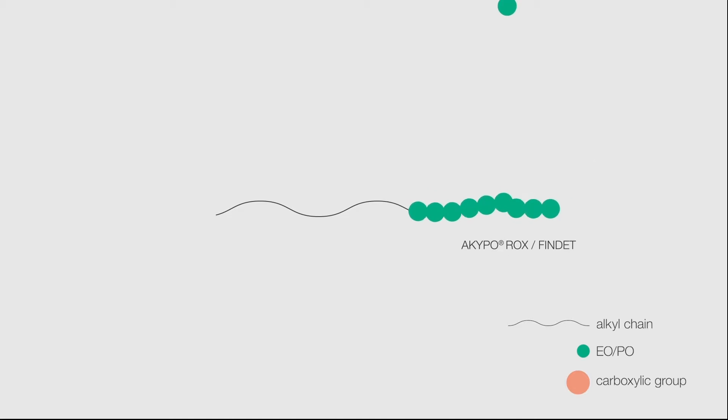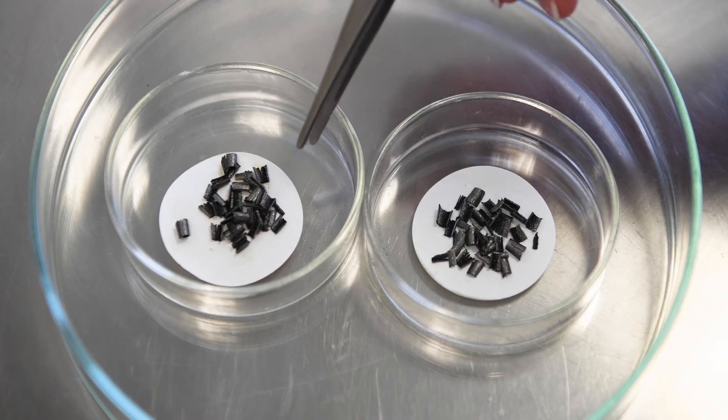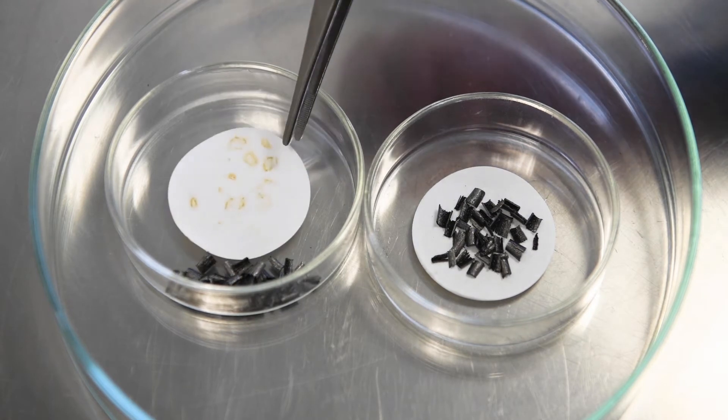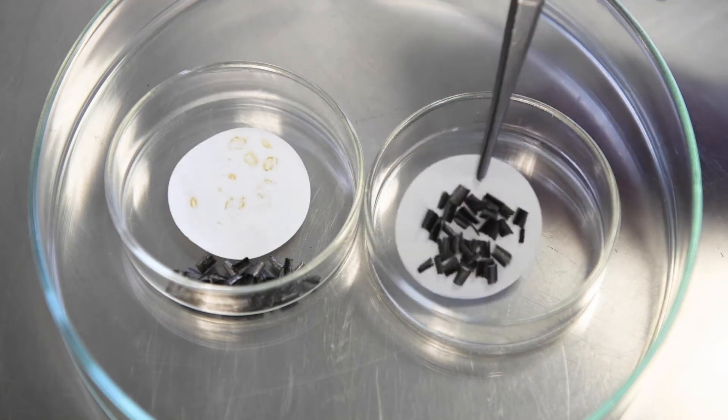The additive can be non-ionic or anionic. Anionic characteristics in particular provide additional multifunctional benefits other than low foaming and lime soap control. The formation of a hydrophobic layer on the metal surface inhibits corrosion reactions, resulting in a decreased corrosion current.